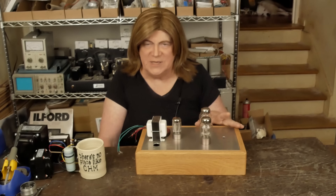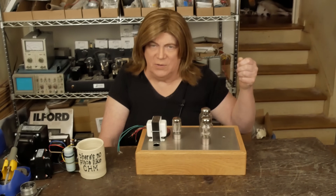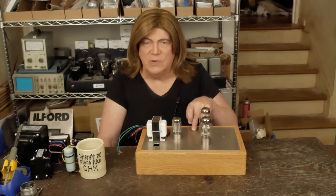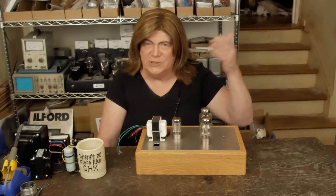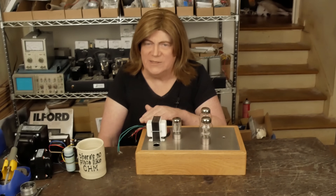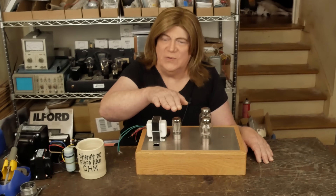What I found was it was kind of an all-or-nothing thing — you put this in, you get all the harmonic distortion, or you take it out and you get none of it. I wanted to make the level of coloration adjustable, so I added small high-quality mil-spec potentiometers next to the input RCA jack so you can adjust the input signal going to the preamp tube, which in turn adjusts how much harmonic distortion it makes while still adjusting the main volume on the output. By having the volume control on the output, the harmonic distortion stays the same at all volume levels, so you get that nice warmth even at low listening levels. With a normal preamp it might sound super clean at low volume and then sound better as you turn it up, but you may not want to listen at that sound pressure level.